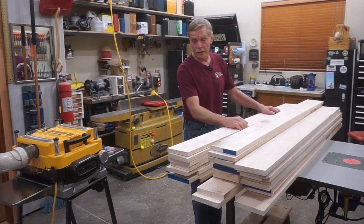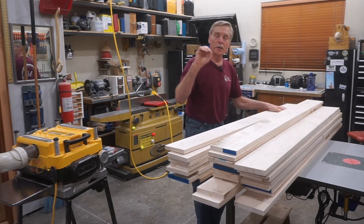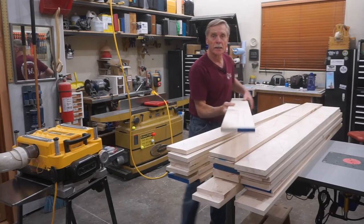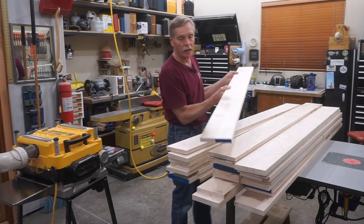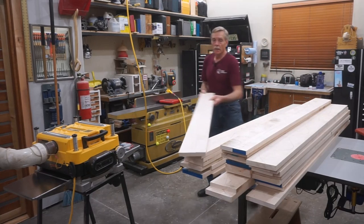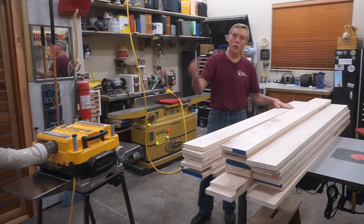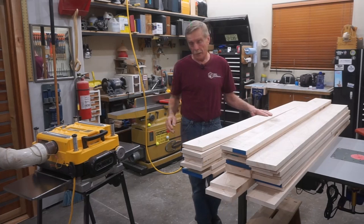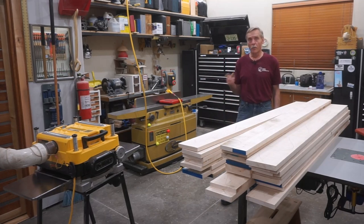These blanks are all prepped — they have squiggle marks on one side and no squiggle marks on the other because they're flat on one face. Because the boards tend to have a little bit of a crown, most of these boards have a hump in them. This board is skinny — three quarters on each end and almost 15/16ths or seven eighths in the middle. Everything is oriented so I can easily slide boards through the thickness planer. Naturally, the first thing to get planed off is the middle where the boards have a hump, and it'll take quite a few passes to get from about seven eighths of an inch all the way down to five eighths — this is certainly the loudest and probably the most monotonous phase, but it goes a lot quicker when I'm working and not talking.